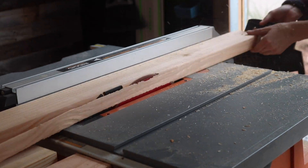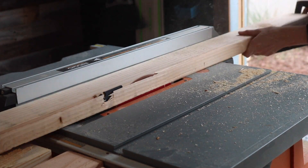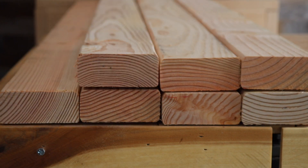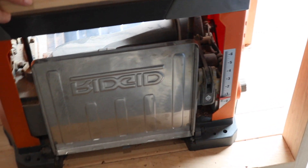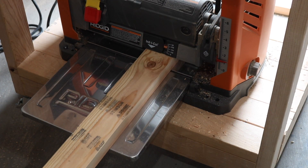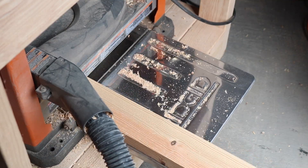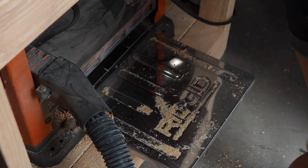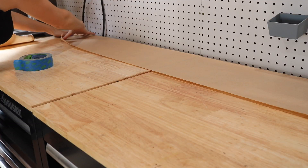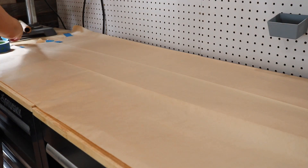These steps are totally optional if you don't have a planer or a table saw, but I wanted to do something a little different and I'll be laminating these pieces together with glue instead of using pocket hole joinery like I usually do. After cutting all of the round edges off, I ran all my pieces through the planer. The dimensions in the published plans were made prior to planing and cutting, just in case you don't have a planer. Once all the shelf pieces were cut and planed, I set up a glue-up station using brown craft paper and blue tape to protect my workbenches.